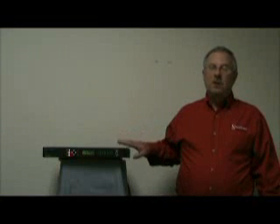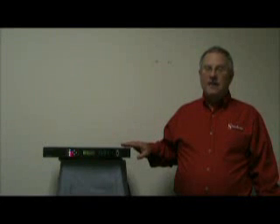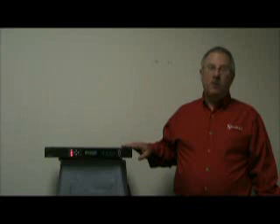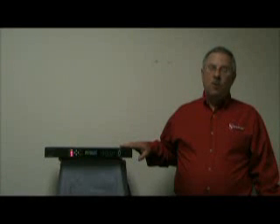The operating temperature range of the unit is minus 30 to plus 60 degrees C. There is a browser for configuration and monitoring — that's how you set up the device itself. There is an SNMP MIB available, which allows you to set up traps and monitor the unit and bring it into an alarming system of your choice. Networking and security features include NTP, both IPv4 and IPv6 addressing, LDAP and RADIUS authentication, SSL and SSH. It can be given an address by DHCP, or you can hard code the address via the RS-232 port on the front or through the web browser once communications are set up.